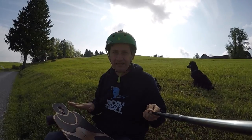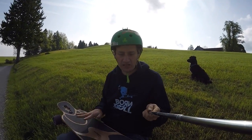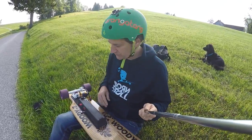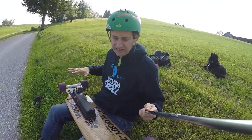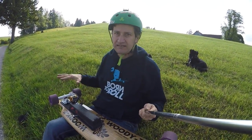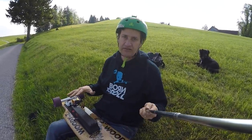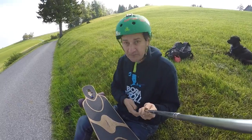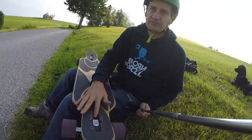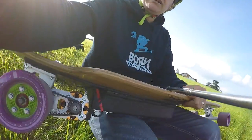The first thing I learned is about the deck. I tried it on a shorter deck before, but a longer board is better. This board is really nice for an electric longboard because when you're riding, you want your feet wide apart — it can sometimes brake or accelerate when you're not expecting it. Feet wider apart gives more stability and a better ride. It's a drop-through deck but I mounted it top-mount to get clearance underneath for the motor.